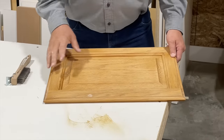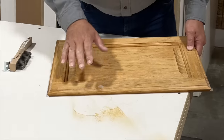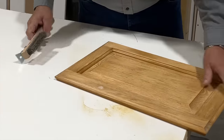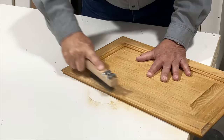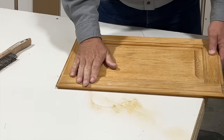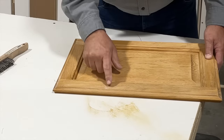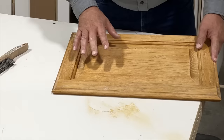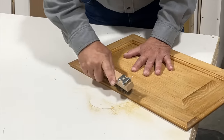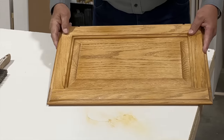We've spent about 10 minutes now wire brushing this door, scrubbing really good and hard. I want to show you one thing — we had a dent in the door that was fairly significant. If we would have left that, it would have shown up as a big black mark with our glaze. So I filled it. Now I'm going to take the wire brush and wire brush away the putty. With the paint, you won't see the dent anymore, and when we put the glaze on it, it'll hide that repair. So if you have any repair work on your existing kitchen, fill it, wire brush it, it'll disappear. We're all done wire brushing now. Off to the paint shop.